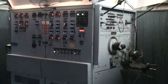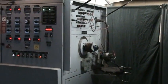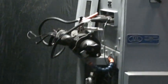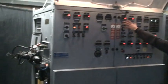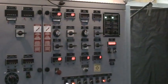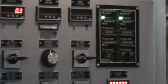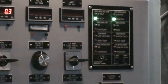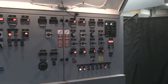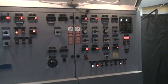The right side of the machine is the alternator and generator test portion and the left side is the starter test portion. Regarding the alternator controls, this entire row is the 24 volt section and this is the 12 volt section. Here you have the fault indicator light section, which will tell you if the load bank fan is not working, if there's low air flow, if the drive motor blower has a problem or the drive motor inverter, over temperature — all that's covered with the warning lights.